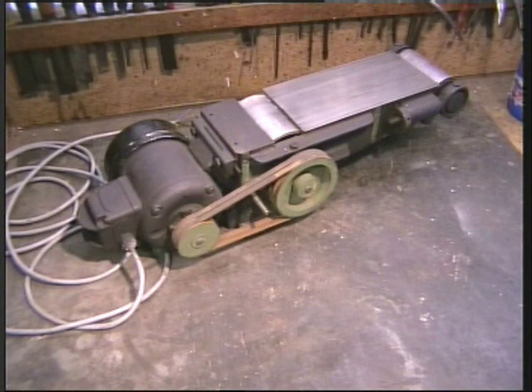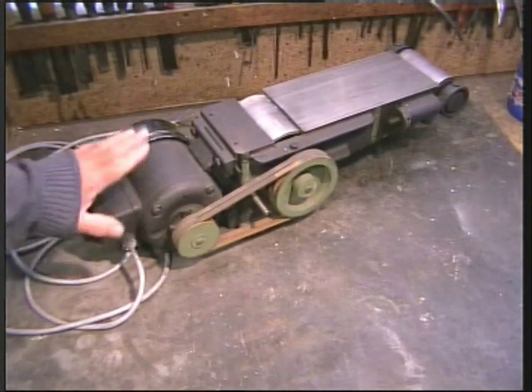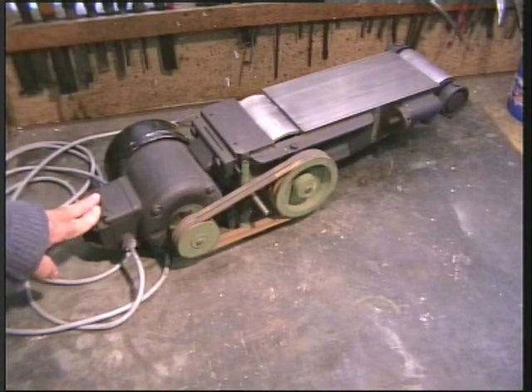But if we are just simply using a lathe to turn something down or a drill to drill a few holes, we can be quite happy that we are not going to use the full or maximum capacity of the machine. And we can get away with a little bit of imbalance within the windings — I will explain this a bit later.